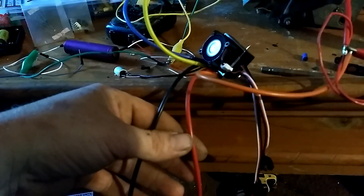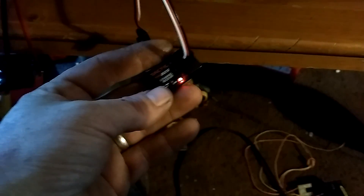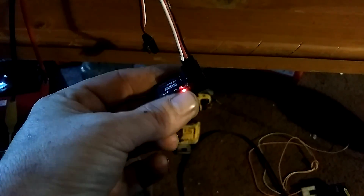12 volts will go real slow and you can't stop it from turning. You've got your positive and negative 12 volts to power your controller — this is just a simple little race car controller, I think it's an XR10. It's a 555 timer with some MOSFETs and a heat sink to keep it cooled down. I tried to get a potentiometer hooked up direct but couldn't, so I spent 50 bucks and got a controller.